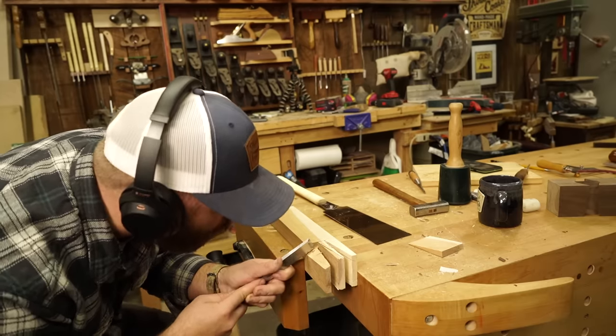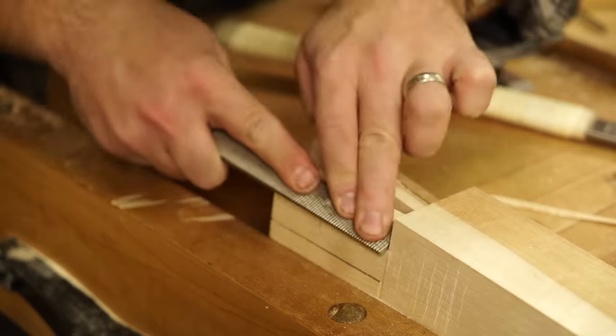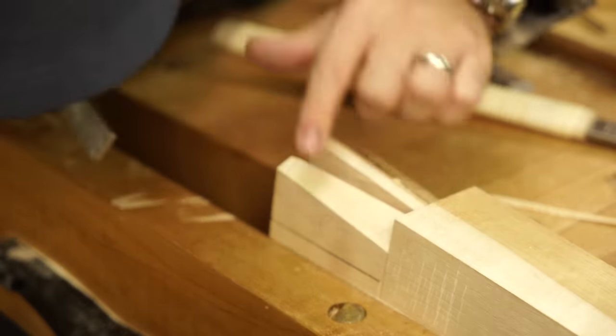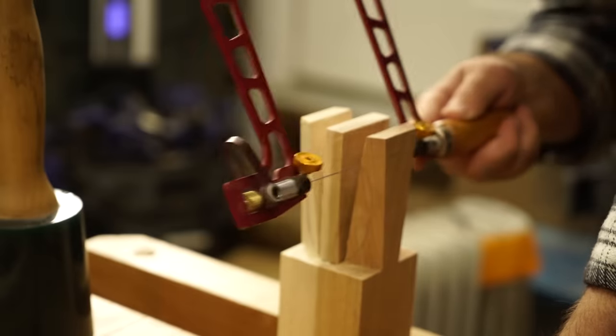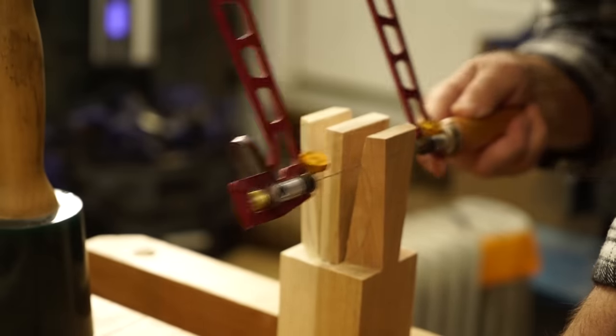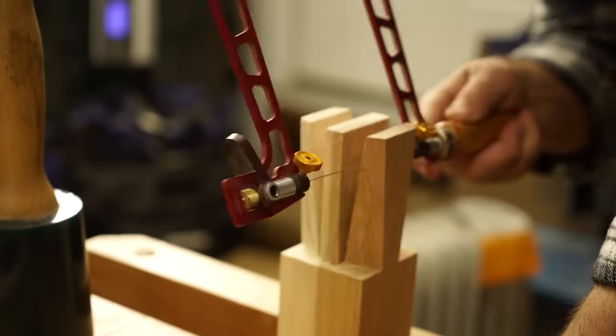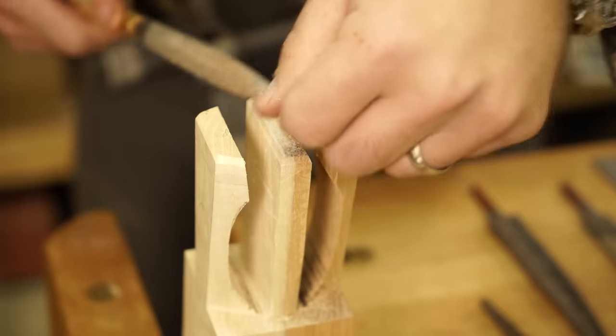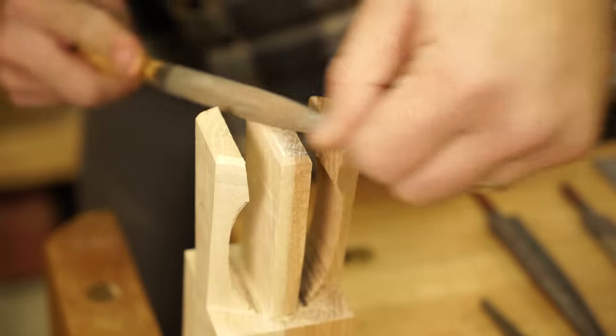Needless to say, it took quite a bit of head scratching, and having a set of calipers really helped make sure everything was spot on. And here is the real key to making this joint possible. You have to cut out curved sections on the two dovetail tenons so that they will bend and you can squeeze them together to start the handle into the mallet head.